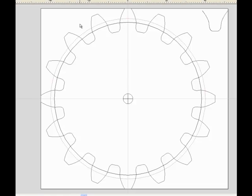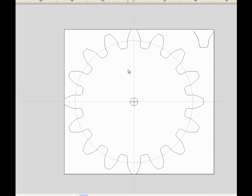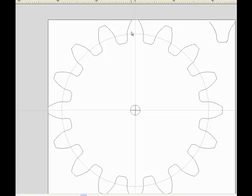So let's get rid of that circle. I think that most people are used to seeing the pitch circle and know what it is. We're left with this circle, which is placed at the base. This is the base circle, and it's the circle which is probably most important to the generation of a gear, and yet understood by fewer people. The base circle is the main mathematical instrument used to generate the involute curves, which are primary to the teeth, of course, on involute teeth.